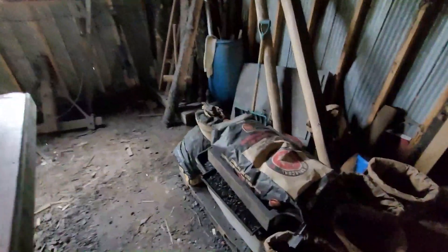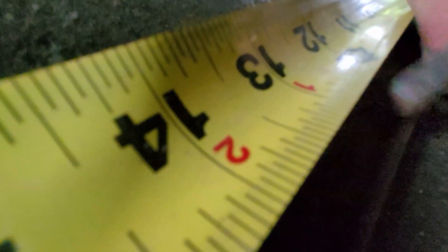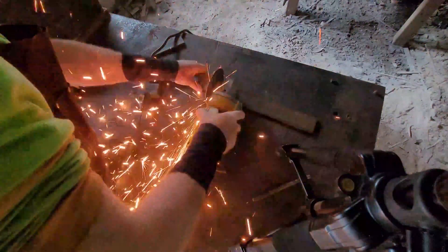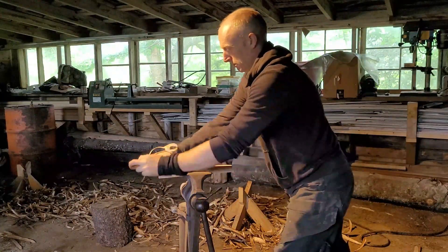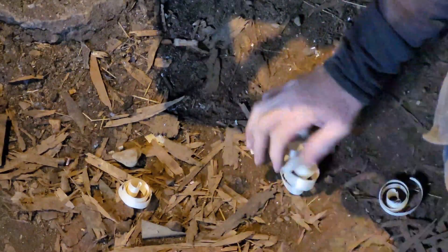To make it, first I've got to cut a bunch of charcoal. For a project like this, a regular bag of barbecue charcoal will usually do the entire project. It's kind of a small project, but 10 pounds you can tend to burn for an entire day. Each piece of steel is 12 inches and then that'll be drawn out. I like to light the fire with wood chips unless it's really wet, and then I use a blowtorch.